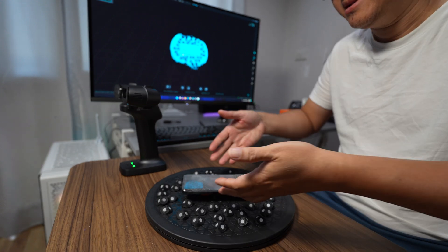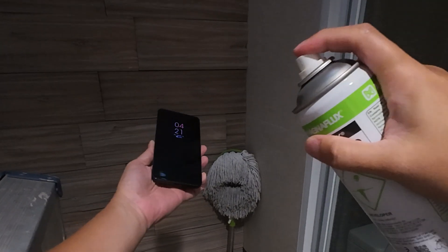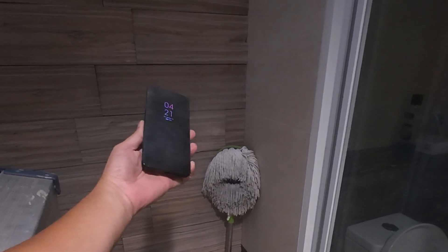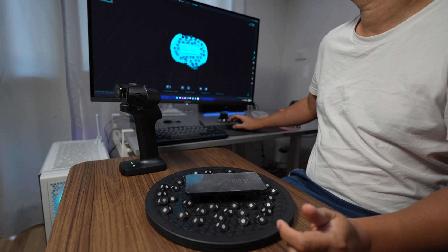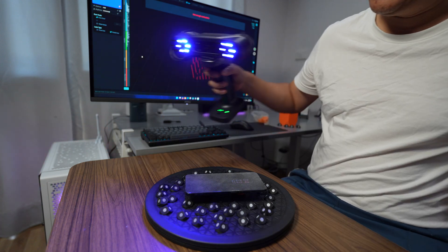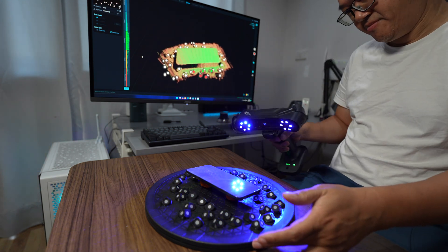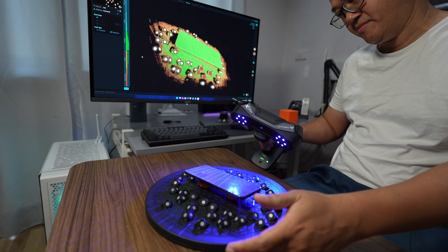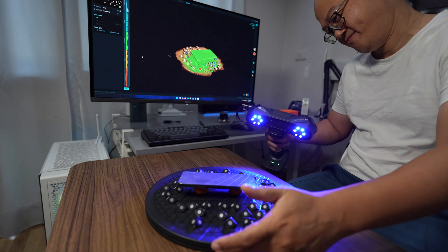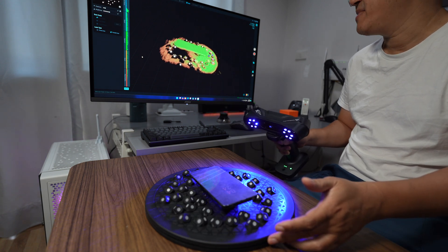Before I make the new scan, I will go back and spray the other side. For the new scan: 0.15 resolution, automatic exposure, and parallel lines. It's important that you scan the edge of the phone — we need an overlap area for merging.